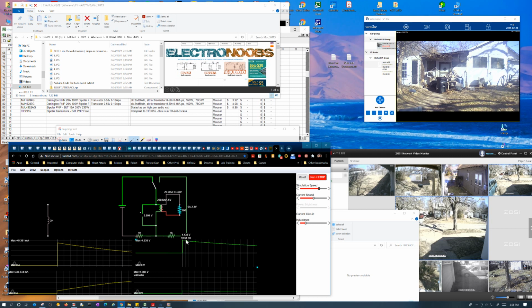In other words, it's acting like a resistor, but since the rate of change, the dI/dt, is slowing down here, the voltage is dropping on the secondary. Because the voltage is dropping on the secondary, maybe that's why, since the dI/dt is slowing down, it's starting to behave more like an inductor. Because the secondary is becoming less relevant because its transfer function is falling off. In other words, its dI/dt is falling off, so the secondary is becoming less and less of an effect because this is just an impulse. Since this is impulse-based, that's perhaps what's going on here. Let's follow this through.